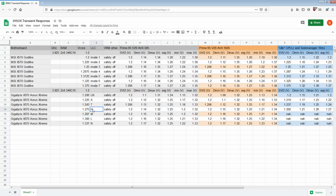So yeah, that's kind of the thing, and I really wonder if it would be possible. The issue is, I did mention that I can connect to the controller of both of these boards because they're International Rectifier, and I will get an Intersil dongle in eventually. I've just been holding off on ordering that for a while now. But I am aware of the existence of the Intersil dongle, and I will have one eventually. But the thing is, even though I can technically try to mess around with the configuration of the VRM of the Aorus Extreme, I know very little about control loops. So that's not the best idea. Probably, well, I guess I can do it with a CPU that I don't care too much about.